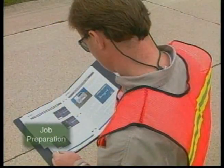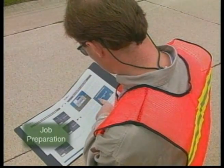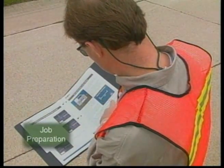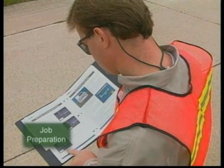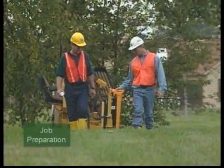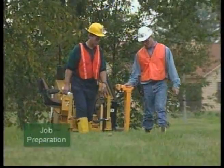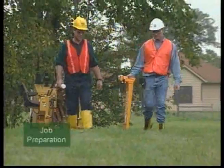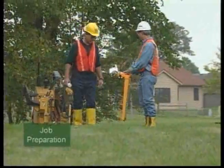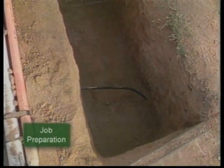To properly identify and adjust for job site interference, you must be able to recognize unstable or potentially inaccurate information. You must also know the limitations of the tracking equipment. As you walk the bore path, also note the actions that will be necessary to maintain the planned bore path. Be sure to consider back ream size, as well as product size, bend radius, and drift. This is a good time to verify that all required exposures have been completed.